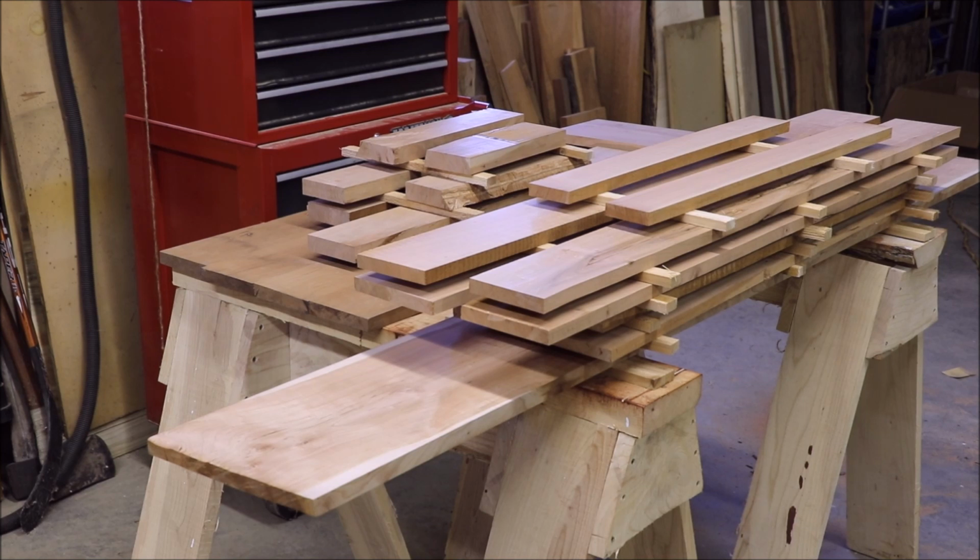So cut it up, get it into rough dimensions, leave yourself a little extra material, and let it sit for a few days, and then go ahead and check it. A really good place to check it is on the infeed or outfeed table of your jointer, assuming that's flat. Mine is dead flat. I had the tables ground.